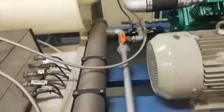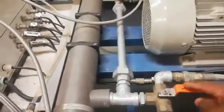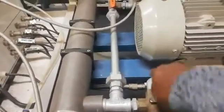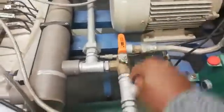From the intercooler, the air goes out from this side. You must make sure your three-way valve is facing the side of the second stage, because you are running the second stage. If it's facing the other direction, your air will not go to the second stage — it will only be running on the first stage.